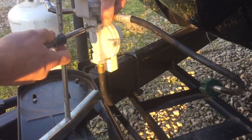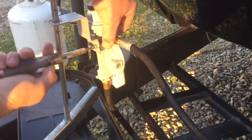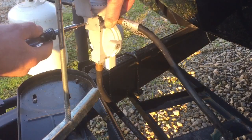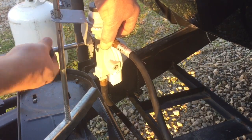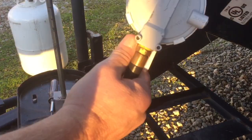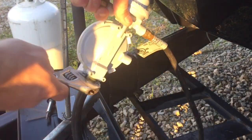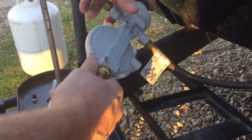Make it easier to see, and then I'll take my bracket. There's just a little bracket here holding the control valve, or the switch valve, or the fitting together. Take the two screws out, one on each side, and it comes loose. Now I've got this one right here — you can see that it's connected to the RV so I need to remove that one to get the valve out of the way. Once I get that loosened up, I can go ahead and just spin it around and it'll come the rest of the way off.